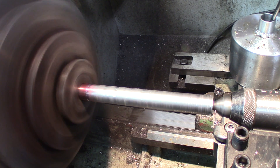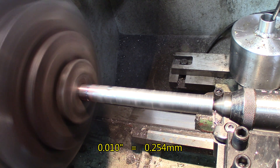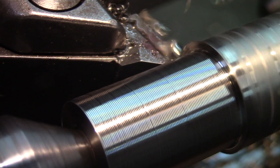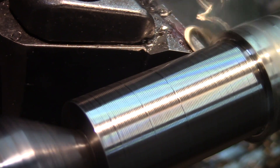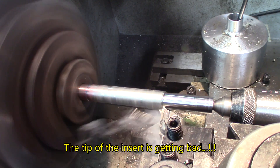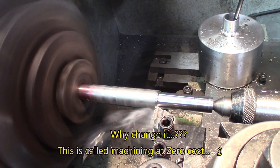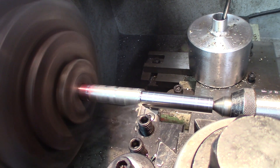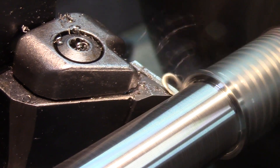Advancing at ten thousandths per revolution — it's pretty aggressive. If you go below that we produce stringy stuff; this will make nice springs, and yes it's a little noisy. Chips are getting thrown pretty much around, but material removal rate is kept to a reasonable speed. We don't have all day.